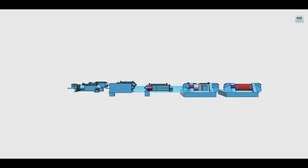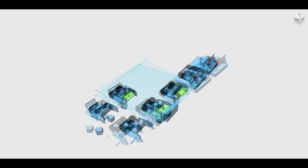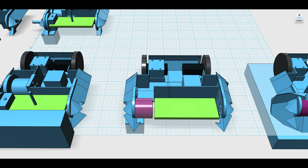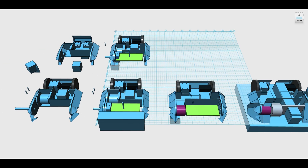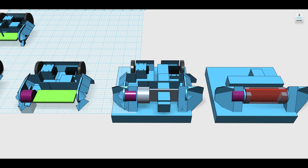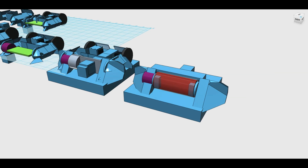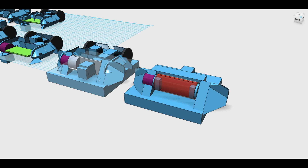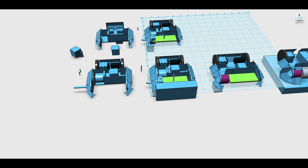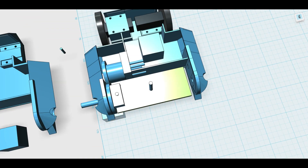I've been trying to come up with a solution to this problem in CAD - really trying. Look at this mess, there is just so much going on in this CAD file right now where I have tried time and time again to fix this issue. Basically the aim was to try and keep this purple 1806 in here, but I think the only way I can do it is to shrink down to a smaller size motor. Even trying to keep the 1806 next to the weapon causes the bot to end up so wide - I'm at like 16 centimeters from side to side, which is crazy. I can't do that in this arena. So that basically leaves going down to a smaller motor, and we're gonna have to see if this works.